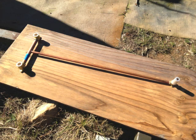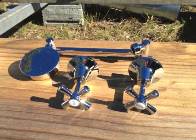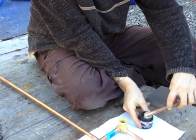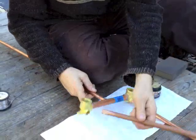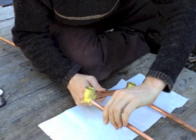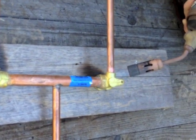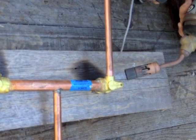I purchased a shower breech, picked some taps and a shower head. I cut 30cm tails and cleaned them up with a block of sandpaper. I dipped it in flux and then inserted it into the brass fittings. I heated up the brass and copper joint, and when I thought it was hot enough I just fed in some solder — if it flows, the joint's good.